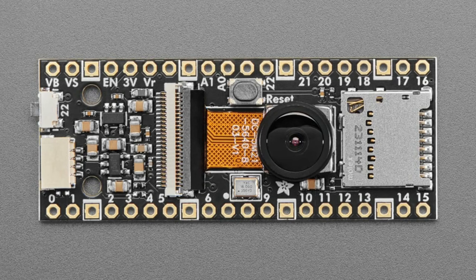These are digital video cameras with a parallel interface. You need to take advantage of the PIO interface on the Raspberry Pi Pico, but it works quite well and can quickly grab all the data from the camera and store it either to an SD card or keep it in memory.